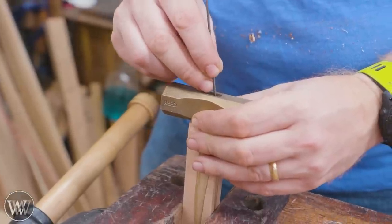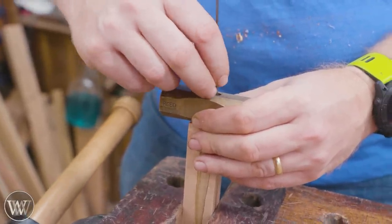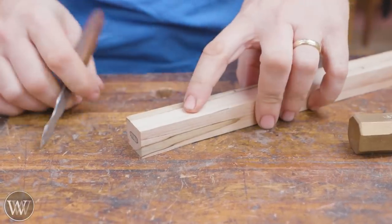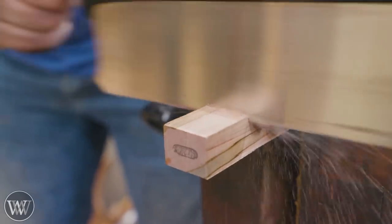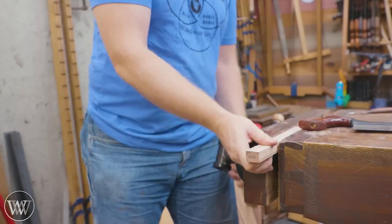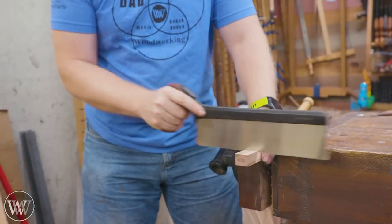I have a lead that goes in a lead holder, and using the lead reaches down there nicely so I can mark it. I set the head on there exactly where I want it, mark it out, and you can see a nice outline of it. Then I'll set the head on the other way and figure out how far down I want the shoulder. I usually want the top to be sticking out about a quarter inch or so - that gives me something to play with.